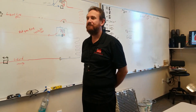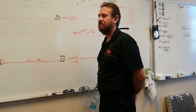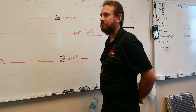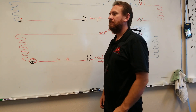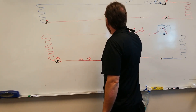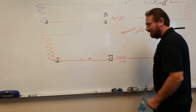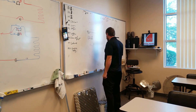Student question: the way that you deal with the check valves for the metering devices — when someone doesn't want to buy a bi-flow liquid line filter dryer, couldn't you do the same thing with two liquid line filter dryers, one this way and one that way, with a check valve on each? You could. You could do that. There are some people that just wouldn't want to spend the extra money, even though it would be saving them in the end. But by the time you bought two filter dryers and two check valves...